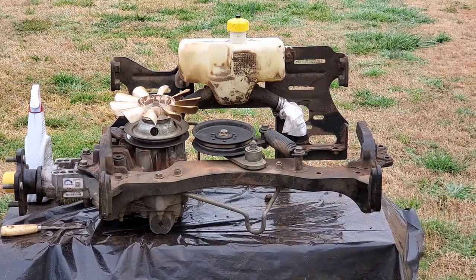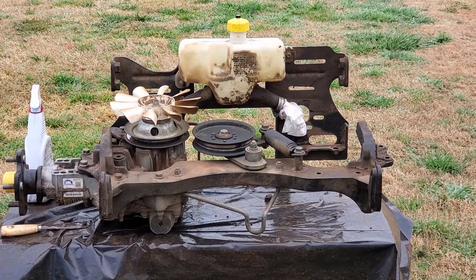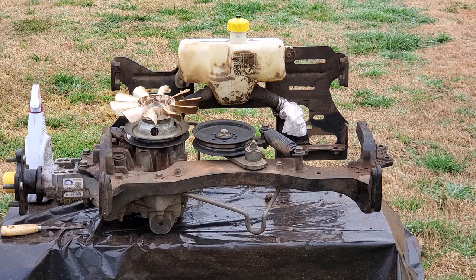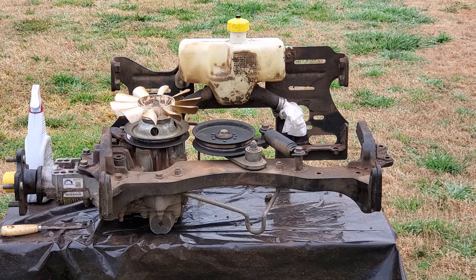I think that's pretty good — knocking off most of the grease and dirt. It was really interesting; some of the areas I thought were part of the case because they're pretty much the same color. Once you start poking at them with a screwdriver, you notice that it's just dirt and grime and oil that's built up in between the fins of the unit. It's got to help this unit to clean all this stuff out because those fins are intended to promote cooling, and with all the dirt and gunk that was in there, I'm sure it wasn't cooling the way it should have been.